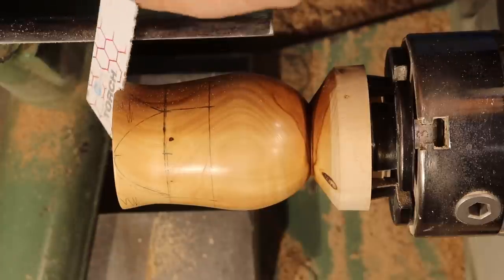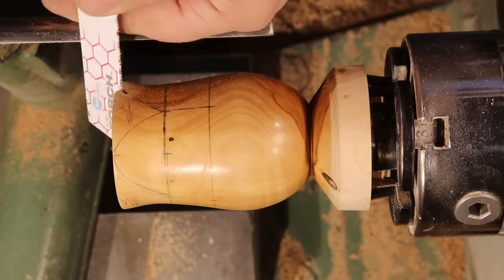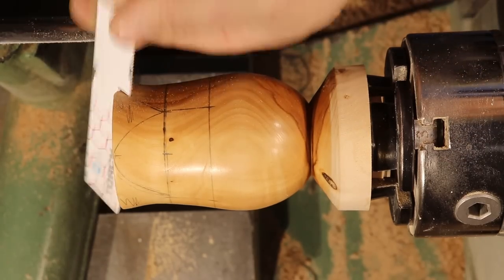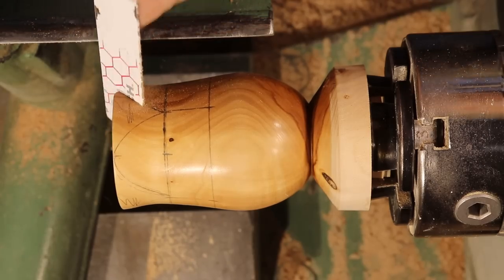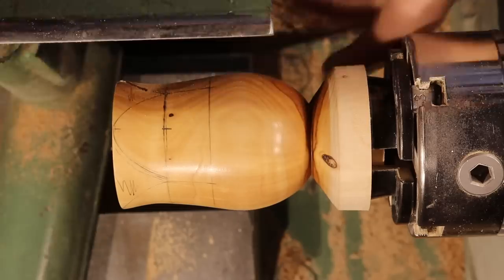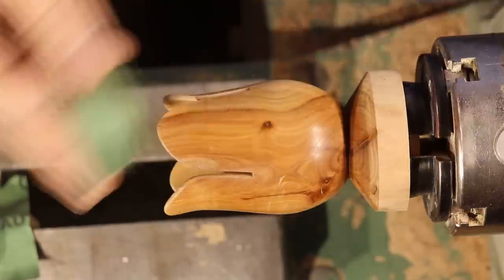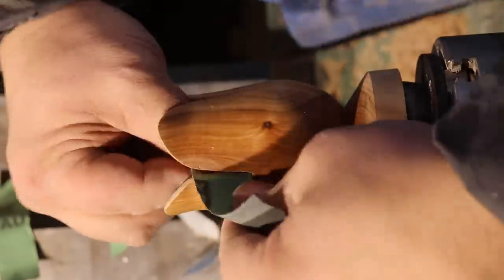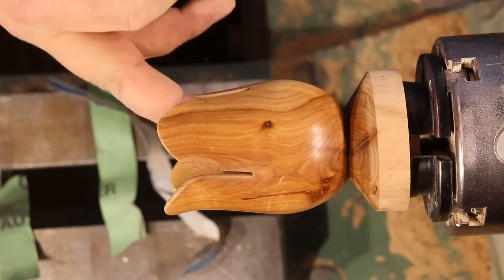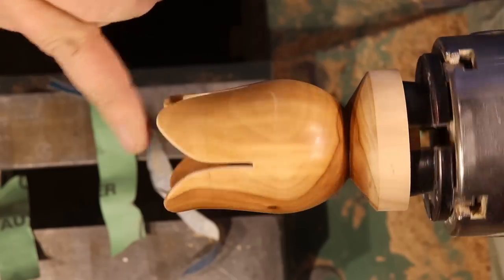I'll spare you watching all of that, but it worked pretty well other than sometimes I'd go just a little too quickly and the tip would hit the outside of the flower. That's why I had to go back and refinish it — it turned out fine in the end. This was the most time-consuming part. I started at 80 grit and finished up with 800 grit to get these nice and smooth, but it was all done by hand and not fast. You can see some marks on the outside where I touched it with the reciprocating blade that I had to fix.